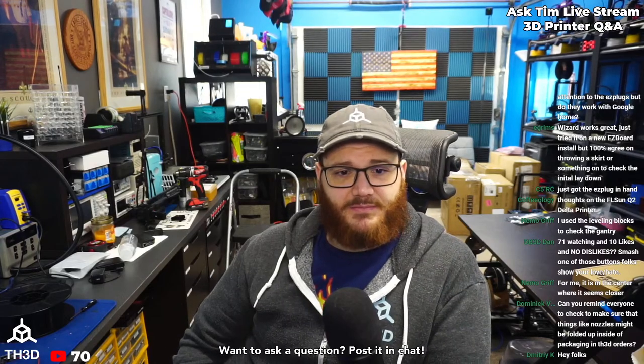Let's see here. Hugo says, quick question. I did a long print on the Ender 5 Pro. I had a layer shift in the same exact spot. Did a different print, it doesn't layer shift. Any ideas where to look? So it sounds like it's not a mechanical issue, but what could be happening is you could have something on the print in that location curling up and physically hitting the nozzle. I hit a couple prints where it would do that, and I'm like, this printer's not losing steps. And then I sat there and watched it once it got close to that point on the print, and I watched the nozzle hit it, and it was enough to cause it to lose a couple steps.